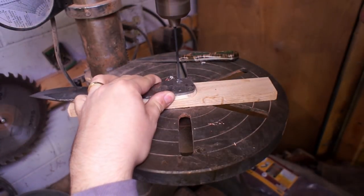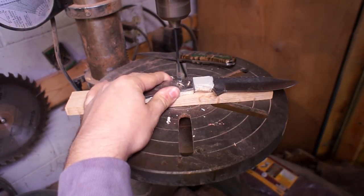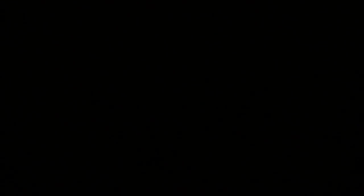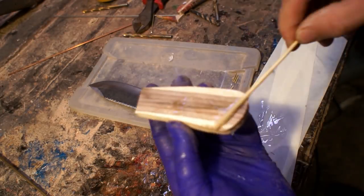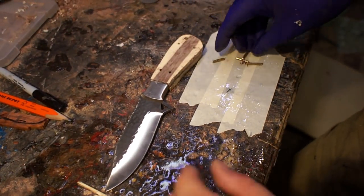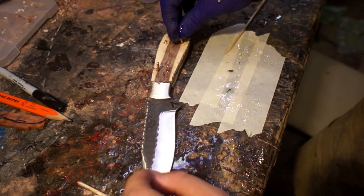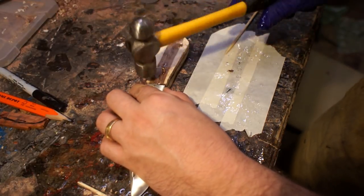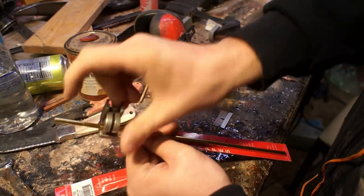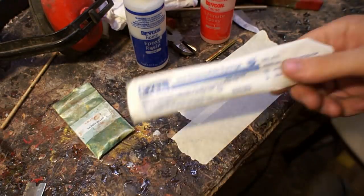Same as the first one, I glue the first side on and then come back in, drill through, and then glue the second half of the scales on so I can re-drill through the other side and get the pins through after the scales are all positioned how I want them. I'm using more of that same two-part DEVCON 5-Minute Epoxy. Let that dry, smear the pins in it, put a little bit in the holes, and hammer those home. Off camera I went in and shaped the knife to basically how I wanted it, then drilled the other hole for the last pin in the very butt of it.